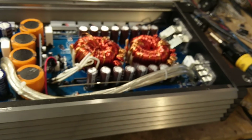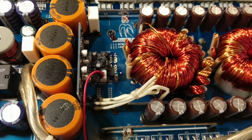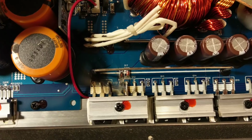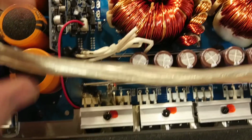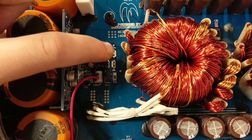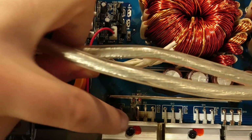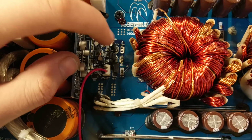So I think what's happened is this amplifier has obviously been on its normal mounting position, laying flat, so the board is technically upside down regularly, right? The power supply section here has blown, and then the power supply section blowing shorts out 12 volts to the MOSFET gate, and then the gate is connected to these PNPs, and these PNPs are connected to ground. So if they get 12 volts fed backwards through the gate of the shorted MOSFET, then it's basically grounding out 12 volts, which means that these get really hot.